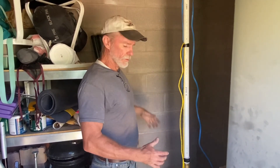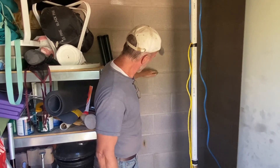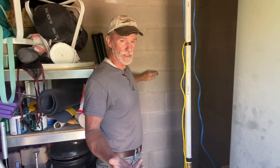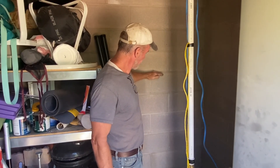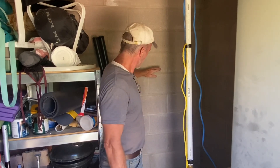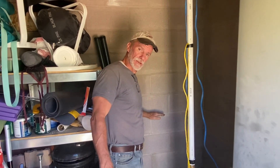When you start pumping water out of it, remember we're not pulling water out of a big tank — we're pulling water out of the water level in the ground. It has to filter through the ground to get to where we're pulling it out. So as we start pulling water out, the water level drops down. Depending on the soil and everything else, that can vary widely. But what we've done is gone five feet below the water level to give us five feet of drawdown, which it'll probably never pull to anyway in this soil. So it should allow us five feet between the water level and where the pump is for drawdown — so it'll continue to pump water.